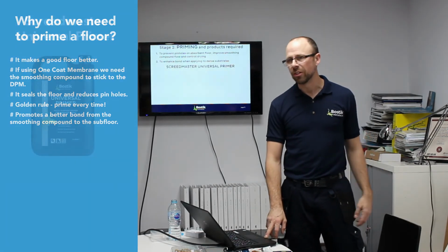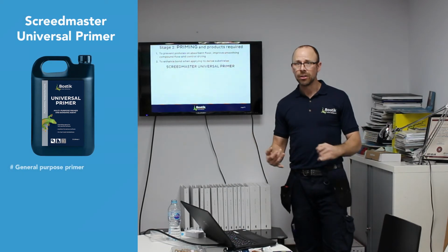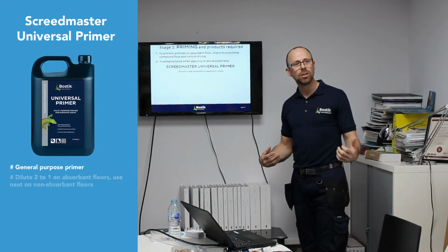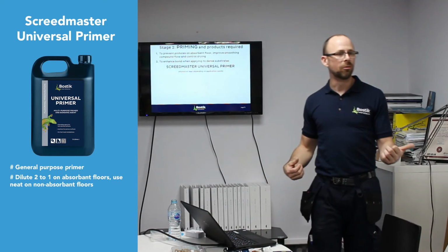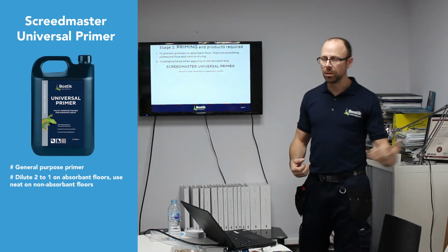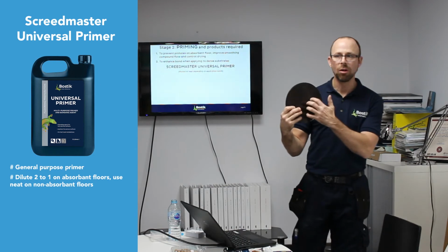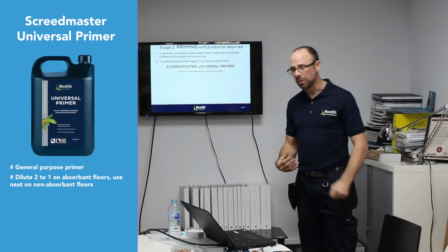So Screedmaster Universal Primer is our general day-to-day primer. You can use it neat or diluted, depending on your application. So Universal Primer, we dilute that on absorbent floors. Anything that's absorbent, dilute it 2 to 1. Non-absorbent, we use it neat. So this is non-absorbent over the DPM, so we'd have to go neat with the primer. And then you go straight on with your smoothing compound.